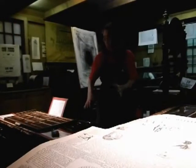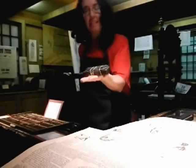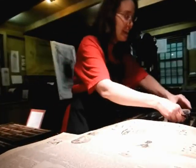Turn it into something that can be printed. And that meant typesetting a newspaper upside down. So here's the top paragraph of a newspaper. Now the reason upside down is because if you did it all backwards, you could, but you'd have to start with the last letter of the last word, and then work your way up, and that would be mentally taxing. Whereas if you do it upside down, then you can still start with the first letter of the first word. So once a paragraph was done, it could go into a column. And here's the column over here.